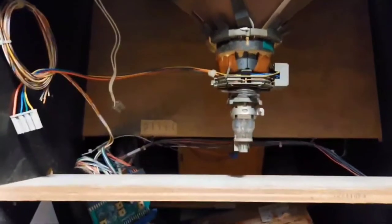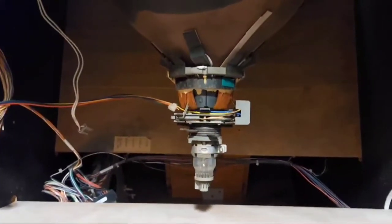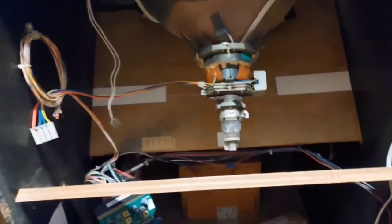Those are pretty long wires, so let me go ahead and get those taped into place. You can see I just used tape to temporarily stick those pieces of cardboard in there — they're about 6 and 3/8ths inches off each side of the inside of the cabinet, and about an inch and a quarter up from the bottom, just enough to leave that little original label exposed. In between those is where my chassis is gonna go. That just keeps me centered up.